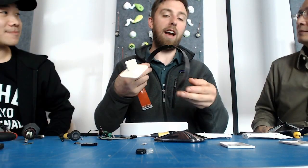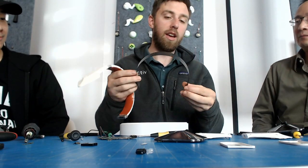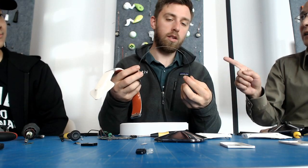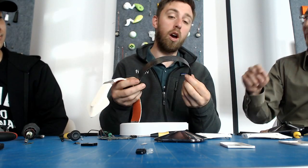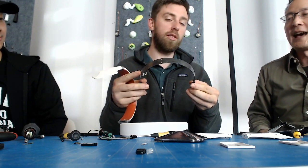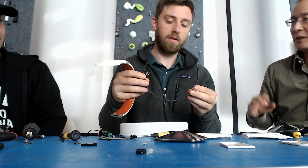And so talk to me. So this would have been manufactured or prototyped flat, right? It's going to be stamped or water jet. And then they stamp it this way. Oh, actually, this one, because it curls back on itself, I don't believe they can. So I think it's rolled. Oh, that's probably true. And you probably would have to roll it to here, so you have a spring back force on it. So that's the magic that the supplier brings. We rely on them to figure it out.